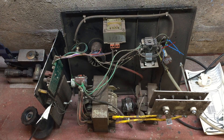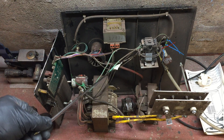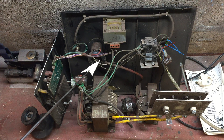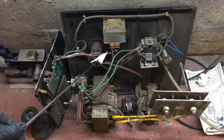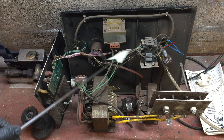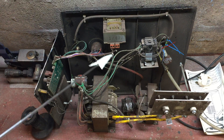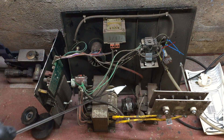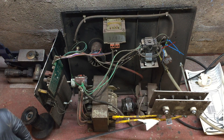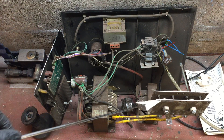There's a basic on/off switch and a warning light. This panel is completely separate — it controls the wire speed, with power coming in all the while. The trigger wires, when you pull the switch, make a connection and operate this relay, calling for power through the low voltage circuit. That turns on the solenoid and starts the little winder motor. As soon as you press the switch you've got power to those components, the contactor relay drops in, and that gives power to the transformer, out through the DC rectifier, out through the choke, out to the lance, and all the way back in from the earth line.